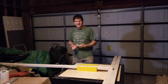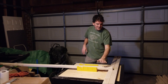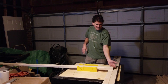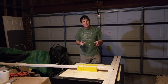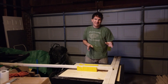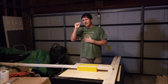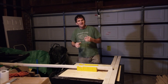I've got three 2x3s that I need to cut and notch out to go around the base molding, which is essentially about 5 inches up around the edge of the room. I don't want to take that molding off or modify it, so I'm going to cut 5 inches up and then about half an inch to three-quarters of an inch into it, so it'll fit right around the molding. The bonus is the room has 8-foot ceilings and these are 8-foot boards, so trimming will be minimal.